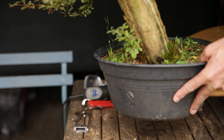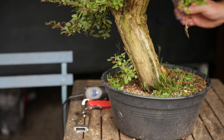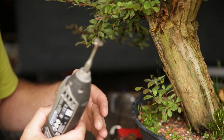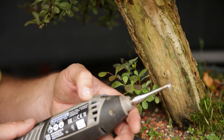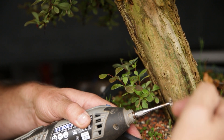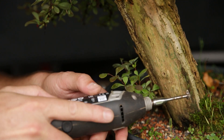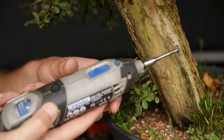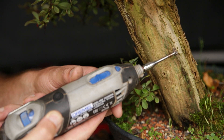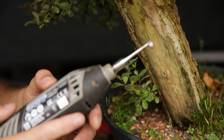Always make sure the pot is stable and can't move away from you. Wear glasses. One key thing when you are carving using a tool like this is that you have to watch out for the rotation. This device rotates in this direction, and if you move from down low up, you pull against the rotation of the machine. That's a lot safer to work than moving down. If you move down it will jump away; here it will bite itself into the wood. Let me show you.